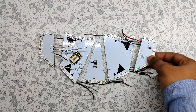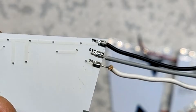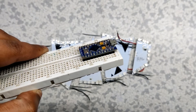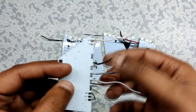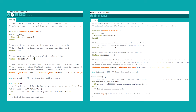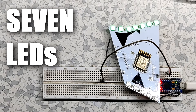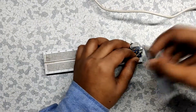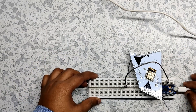These are the 5 PCBs that have been reflowed. For testing each board's LED connectivity, I soldered 3 wires on each PCB's VCC, DIN, and GND pads, and used a Pro Micro loaded with a basic NeoPixel test sketch. Each PCB has 2 different LED arrays without connectivity between their DOUT and DIN pads, and the code is different for each PCB since they don't have the same number of LEDs. For example, one PCB has 7 LEDs on one side and another has 6. We can add one extra wire for the data-in pin to test such PCBs, and by this method I tested each PCB's LED connectivity.